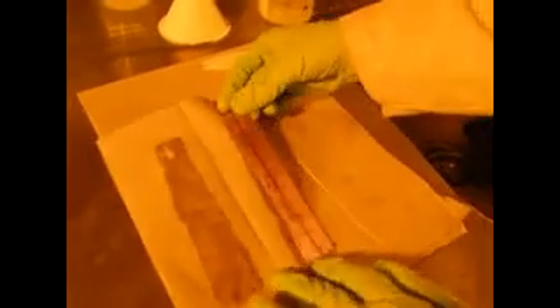Okay, that's good. Now we're going to move the strip line and rinse it off in water and pat it dry. Next, we're going to put it in the etchant, which will remove any copper that's not protected. If you look closely, the photoresist that wasn't broken down creates a protective barrier.